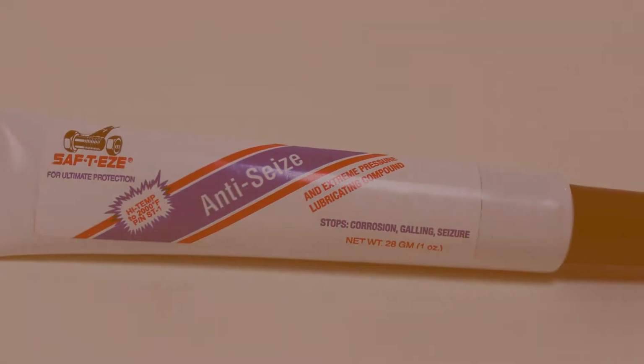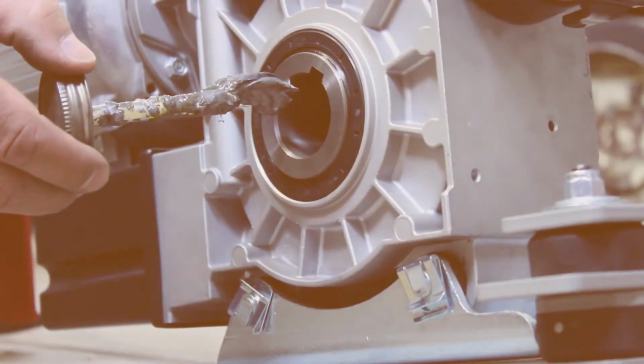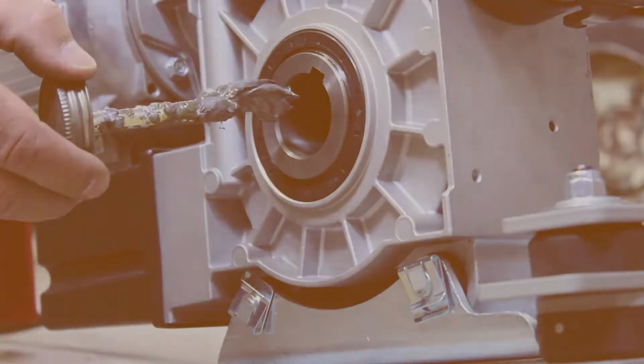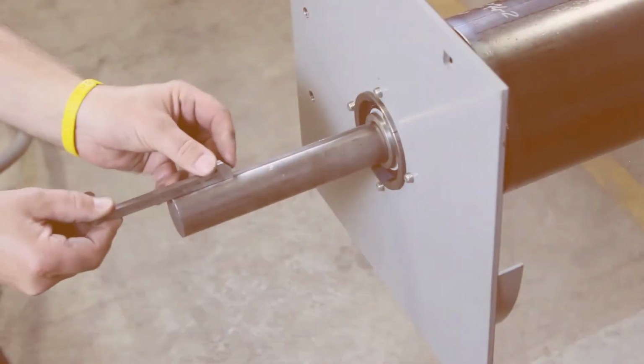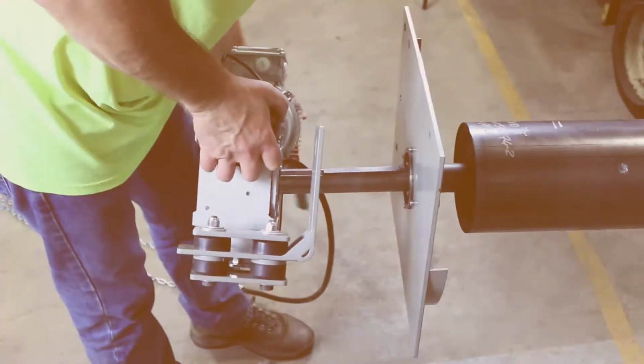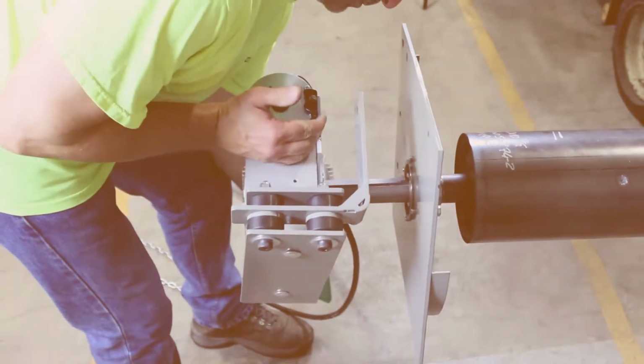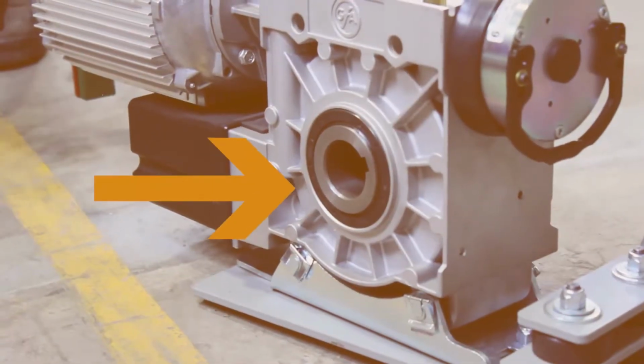Prior to installation, apply the anti-seize lubricant to the gear end, gib key, and inside hub of the operator. Place the gib key in the keyway of the gear end. Slide the operator over the gear end of the gib key, ensuring the keyways are aligned. The keyways can be aligned by rotating the barrel by hand or utilizing the auxiliary hand chain on the operator.